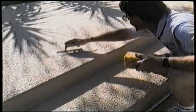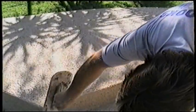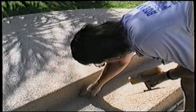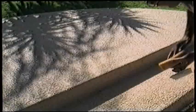The most important area to trowel on a Kool Deck like this is the areas that are drying the quickest. If you need to get the cement to set up quicker, you can always take an air blower to the areas that need it. Little critiquing with the fingertips.